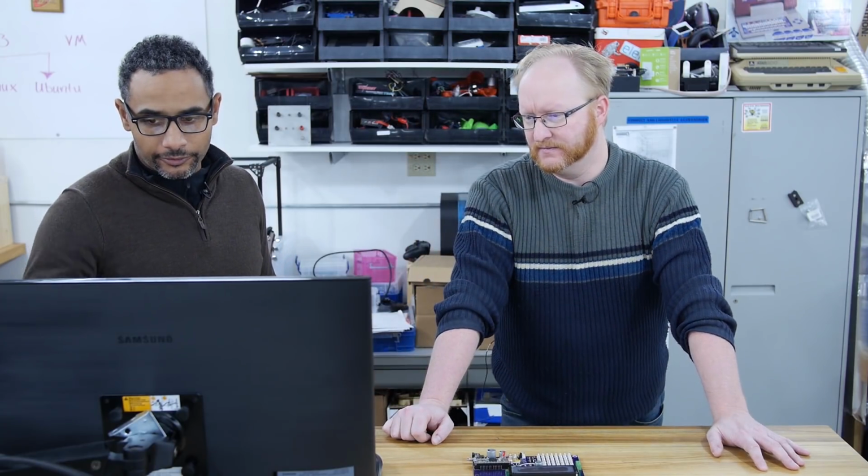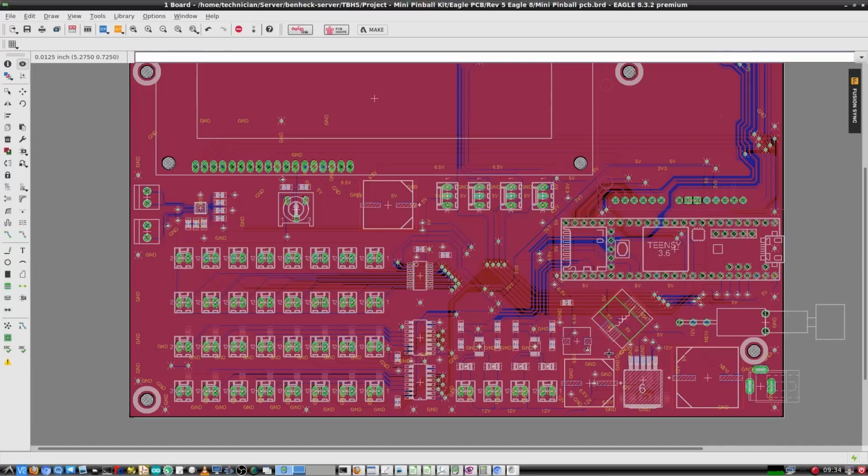Where's the variable power supply on this? Well, actually, I found a regulator that puts out 6.5. Oh, really? From 12? Yeah. Is it also a switcher? Yep, and that's underneath. There's also additional components for that. Oh, well, okay, so this is the 5-volt regulator, then you have a 6.5-volt regulator underneath. I wish we didn't have to do that, but I feel the same way.